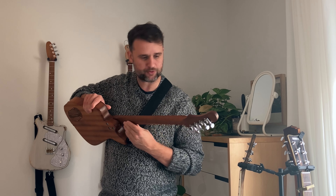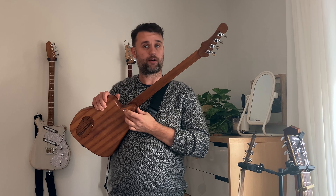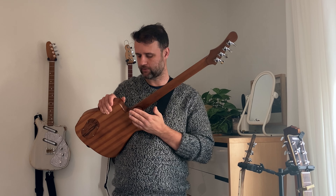This neck also uses what I call the pseudo one-piece neck technique — I took the fretboard and neck material from the same piece of wood. I sliced off the top piece for the fretboard, opened it up, put the truss rod in, cut the channels and fret slots, and put it back on. It looks like a one-piece neck; it's hard to find the glue line and the grain match is great overall. On the back there are three large screws holding the neck on, making it easy to remove for any work — I always prefer bolt-on necks.